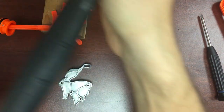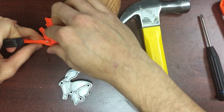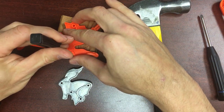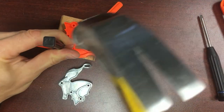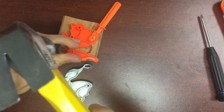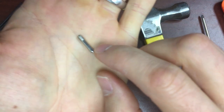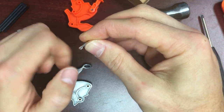I'm going to set that up and use the hammer. I have a hole drilled in a wooden block that lets me drive the pin out. You do need something like this to support your plastic parts because you don't want to break the plunger rod or spring guide. I'm going to set that dead center. That one was pretty stubborn — there was no way I would get that out by hand. There's the pin; you can see the knurling on one side and how it's smooth on the other. Most of the time you'll end up pounding it out a little bit, and then just grab it with the pliers and pull it out, but this time it was under a lot of pressure.